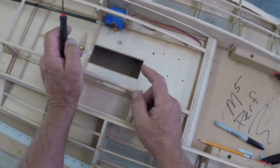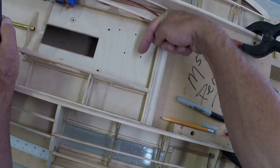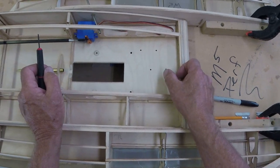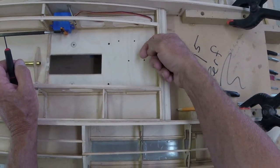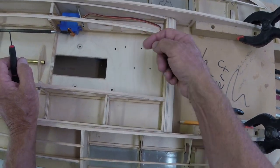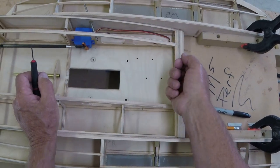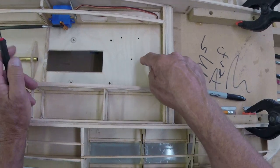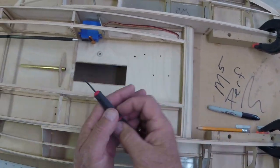I did a solo video, I'm pretty sure, on this thing right here. Can you see it? On the throttle servo and how to build its mounting bracket. And the same thing, little 440 aluminum screws glued using G-Flex to an aluminum bracket. Really quick and easy to change your servo if you need to. Two screws, the whole thing's out in your hand. Two more screws, the servo's off. Really easy if you have this thing handy in your box.